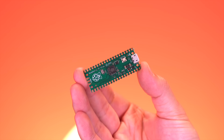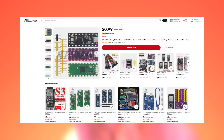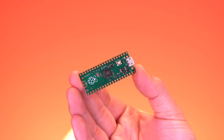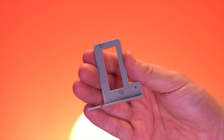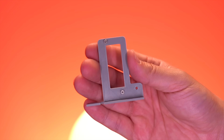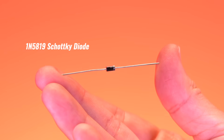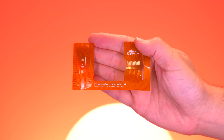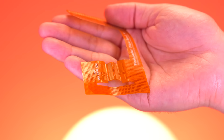For this project, you'll need a few things. Obviously, you'll need a Raspberry Pi Pico like this one here, but according to Makao, you can even use some clone Picos since he made the firmware run at a reduced clock speed of 200MHz. But he still does recommend getting an authentic Pico for perfect compatibility. Additionally, you'll need this bracket which you can 3D print yourself, as well as two M2 5mm screws. This specific diode as outlined on their GitHub page is also required. And lastly, you will need this custom flex ribbon cable, which you can have fabricated from companies like PCBWay, which just so happens to be the sponsor of today's video.